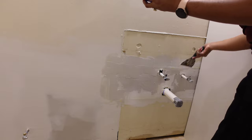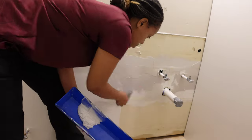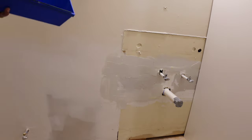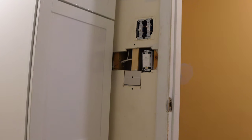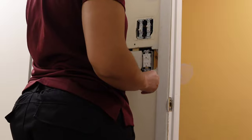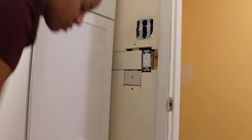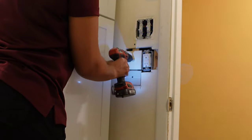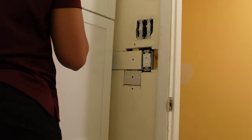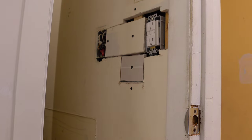The contractor and I were going back and forth on the drywall too. He did not like how I was doing it, but it's my damn house, and if I'm okay with my lumpy and uneven walls, I don't see what the problem is. He was supposed to come in and paint after me, so he was pretty much waiting for me and the pressure was getting worse — I was losing my freaking mind. As you can see, the pantry cabinet goes all the way up the wall, and the light fixture or plug was right where the pantry is. So that's why we had to move it closer to the door jamb and changed it out for a GFCI — my husband said it was a better choice, and I agreed. I did have to install a small piece of wood real quick. There's the old plug right there behind the pantry. We did install a flat cover over it so those wires wouldn't be exposed, but they have to remain in that box because of code — you can't just have live wires free in between the walls.